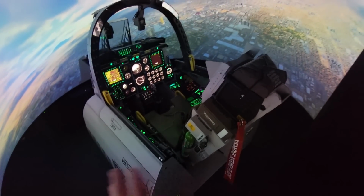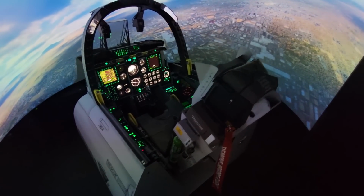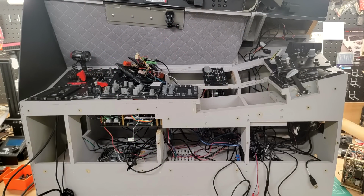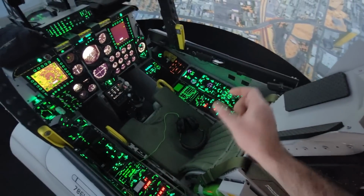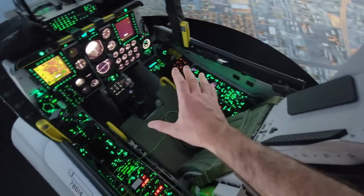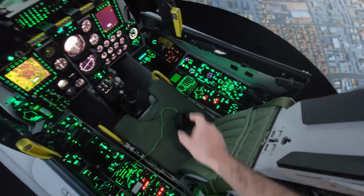It also had a full teardown, so you can't really tell much different from here. But I rewired both consoles, so both consoles came out completely, got completely stripped down. When I built this thing, it was each individual panel at a time, and now that it's all together, I realise that I can share power. For example, like the backlight, I had one hub in here for backlight, and then cables going out to each panel.